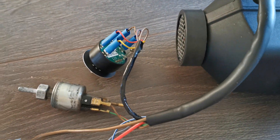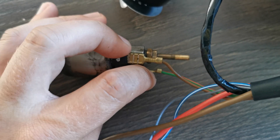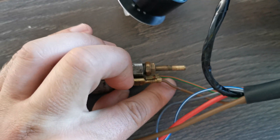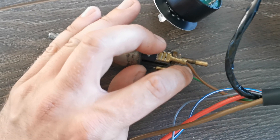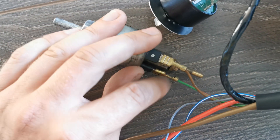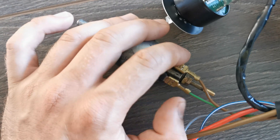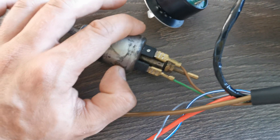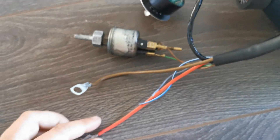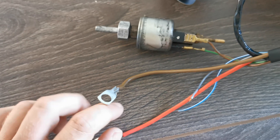You also have a brown wire and a green one with red stripe. The green one with red stripe comes from the control module. The brown one is the common zero wire, and those two are for the diesel pump. They don't have a direction — you can swap them over. That should not be a problem; I don't guarantee it, but I'm pretty sure. Check carefully.